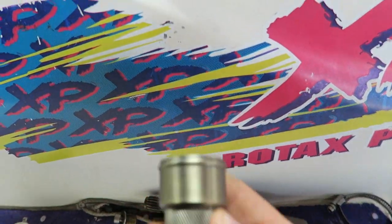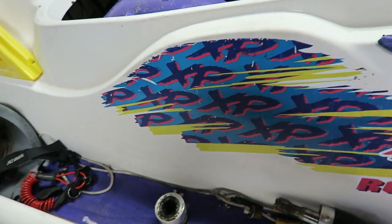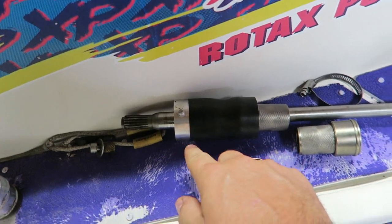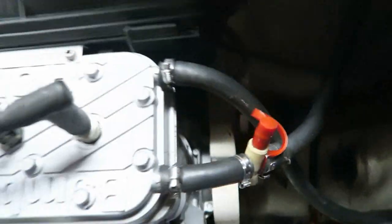This is going to be our new hull insert, because this one — it's hard to see, but it's all chewed up. It's supposed to be all the way around. So this is going to go inside there like that. Of course I've got to cut off the old piece, then this piece will slide in. I'll slide the shaft back in, put the bearing on — you put the bearing and everything on just like this. It'll connect right here. I've got a new seal for it that's laying around here somewhere — I probably lost it, might even have to buy another one.